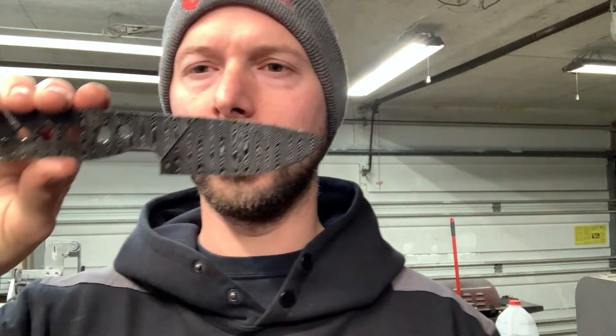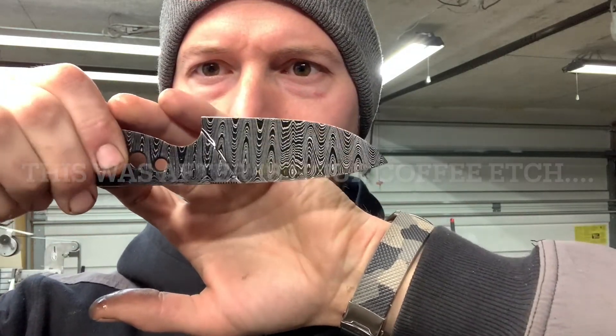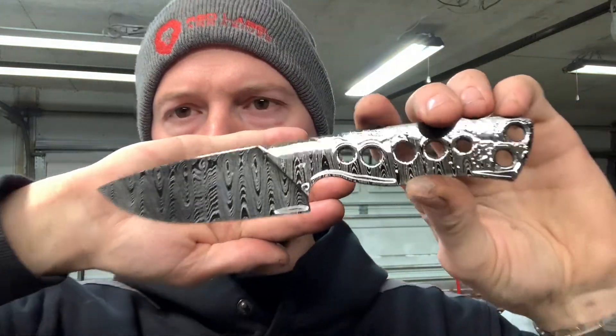That about wraps it up. Once you pull it out of the coffee, rinse it really good, neutralize it with ammonia Windex, dry it off with compressed air, and then coat it with whatever oil you like — I dunk it in 3-in-1 oil, or you can cover it in Axe Wax. That is the end result. There are a lot of different ways to finish Damascus, and depending on what Damascus you're using it changes how you finish it. Hopefully this answers your question on how I finish Alabama Damascus — and this works for all of their patterns I've tried, their low layer, and one called redneck skin. Make sure you subscribe to the channel, and as always, thanks for watching.